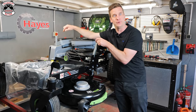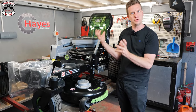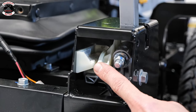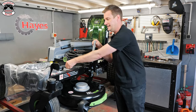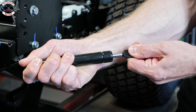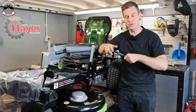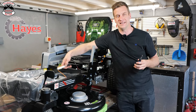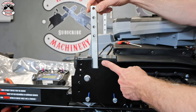These two things here go forwards and backwards — if you pull them the other way, that's what makes you turn. I thought, let's use what's already there, because inside here there's already a potentiometer which tells the motors which way to go. Underneath there is a gas strut and that's what creates the resistance on your arms so you're not too jerky — it makes it nice and smooth. I thought: take that out and replace it with a linear actuator.